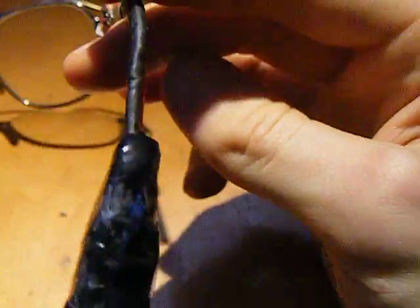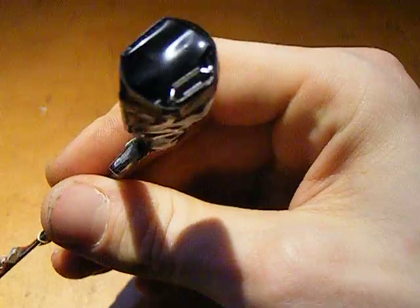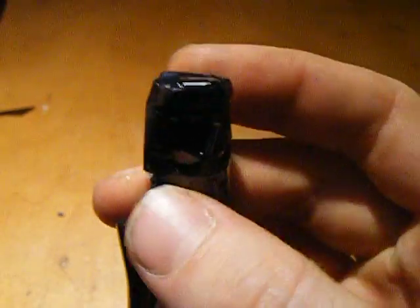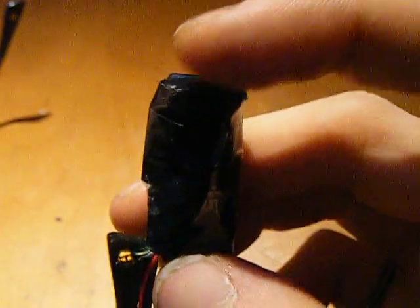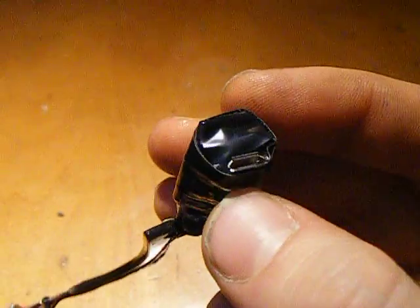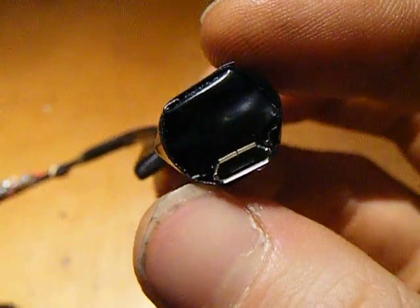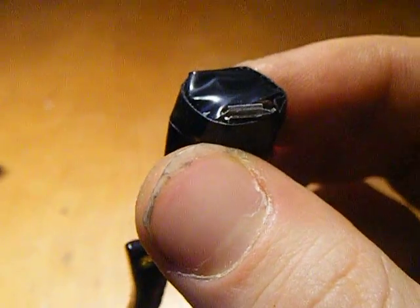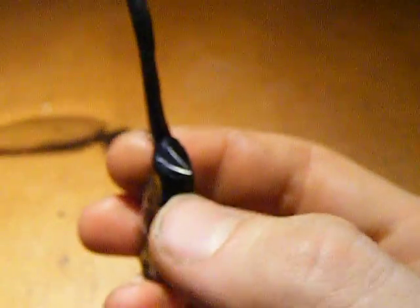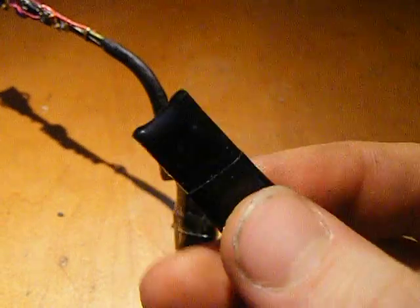Back here I used to have a nickel metal pack — now it's lithium polymer. I've put on a little micro USB charge circuit. I took one of those SparkFun boards; they're about this length but pretty skinny. I basically chopped it in half, filed it down, tweaked it a little, and I was able to get the board down to about 40% of its original size. I soldered it onto a little brass box in here that I made, which protects a lithium cell like this.